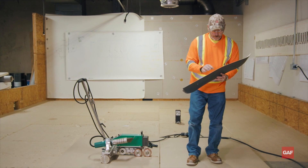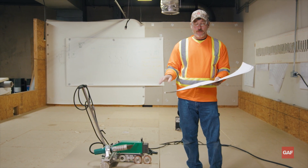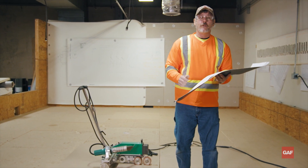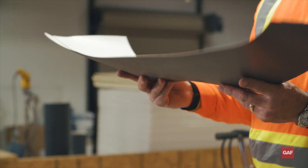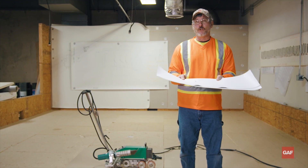I want you as the viewer to pay attention — I just peeled that apart. You'll notice that at 900 and 1,000, I couldn't peel that apart. At 1,148, I want you to see the gray. There's gray under this void. That's something really important to pay attention to for the guy running this machine. There's a gray under here — this is a void. When we do the test cuts, we're going to see something a little bit different.